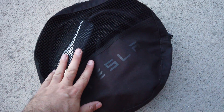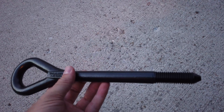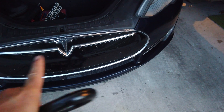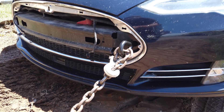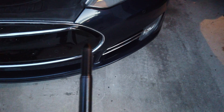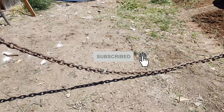Something I forgot to mention: in the bag that comes with the EVSE, on the back there's a compartment you can unzip and it has this item here. You might wonder what that is — it's for towing. If the car needs to get pulled up onto a flatbed tow truck, you have to take off the nose cone, which is fairly easy — pry with a screwdriver on either side or hit the top and it pops out. Then there's a hole you plug this into, and be aware it has counter-rotating threads, so you turn it to the left to screw it in.